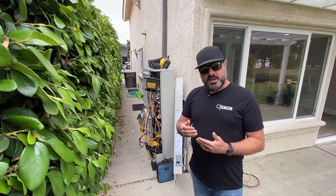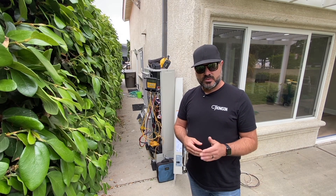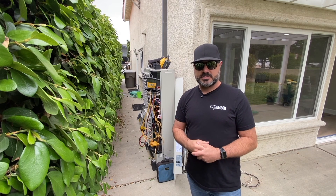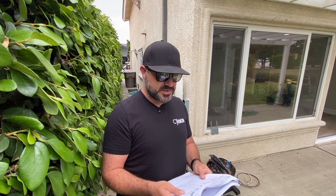I'm going to get into all the meat and potatoes right now for the HVAC installers out there — how to properly commission a Daikin Fit system from beginning to end. We haven't even powered this unit on yet. First things first: read the manual. After you've pressurized the system with nitrogen and after you've made your welds or press connections to verify there are no leaks in your piping, you're going to pull a proper deep triple vacuum on the system, making sure that third vacuum goes below 500 microns and holds nicely.